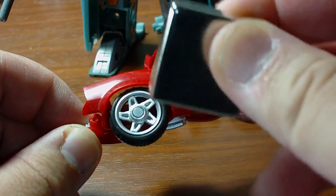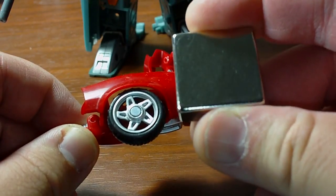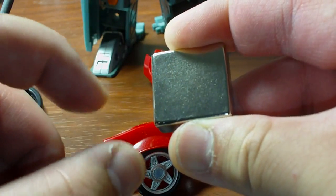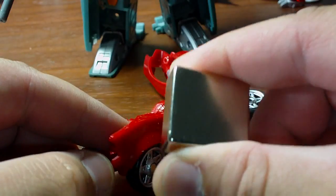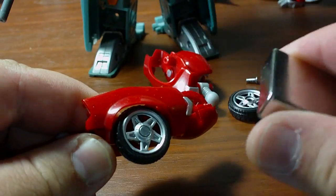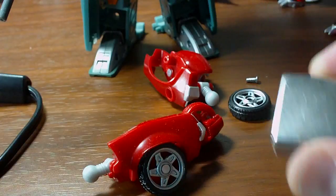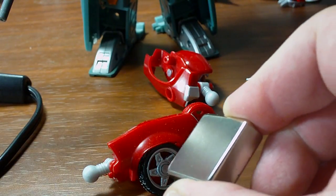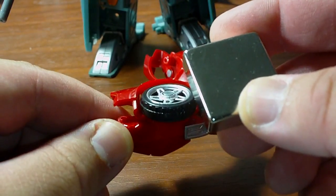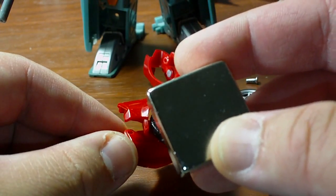I'll just show you here — this is the magnet. It's quite small, but according to the manufacturer's data sheet, it has about a 50-pound pull force. Meaning, when you put this magnet on a piece of metal that makes contact and covers a decent amount of surface, it takes an equivalent of about 50 pounds or more of strength to remove this magnet from a piece of metal directly contacting a good portion of the surface. Even without having a significant portion of the magnet surface in contact with metal, you can see how strong it is — even though this metal part is a couple of inches away, when I move it closer, it will be attracted and pulled to it. You really do need a strong magnet. If you don't have a scrap hard drive to disassemble and harvest its magnets, look into finding rare earth magnets — also called neodymium magnets.